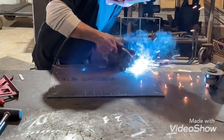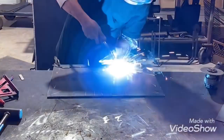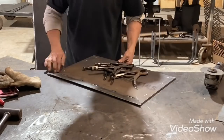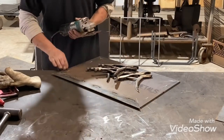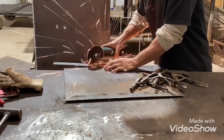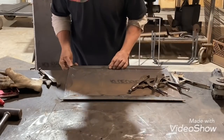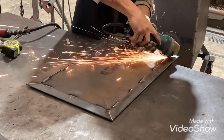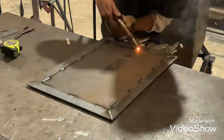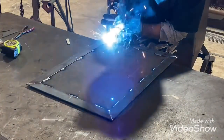I've got another reverse flow going now that I'm trying to do something a little different with the firebox. I wish it wouldn't have been already half built — I had it built a little over a year ago and just never finished it. If you got that flat bar butted up right against each other with no gap, it doesn't weld that good. But if you open that gap up it'll do a little better.